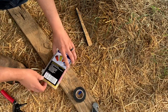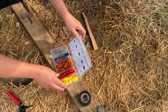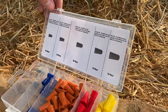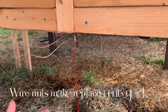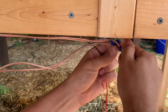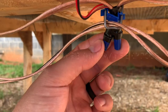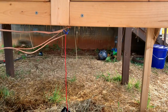I'm going to get another wire nut from this wire connector assortment — I believe I got it at Harbor Freight, fairly inexpensive. They have different sizes in here and it tells you how many wires you should use in case you're unfamiliar with how to use them. I like to use these; some people prefer butt splices where you crimp both ends, but this to me is the easiest and quickest way because all you do is twist them on until it's kind of tight and they all start to turn. For the negative side, same thing — wrap the new wire around clockwise. The reason I do clockwise is because when you're putting on your cap you're going clockwise as well to tighten it, and you want all the strands to mesh together in the same direction, not go against each other and split apart. What I like to do — as you can see on the other ones — is just put a piece of electrical tape around it so no water or anything gets in there. Just extra protection.